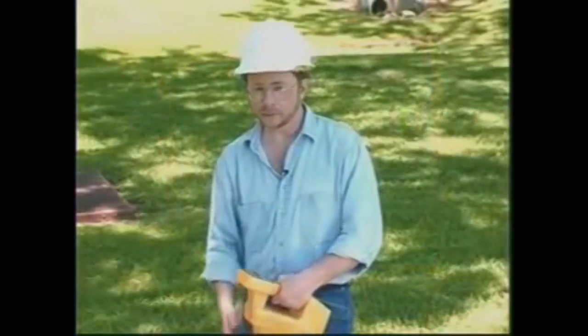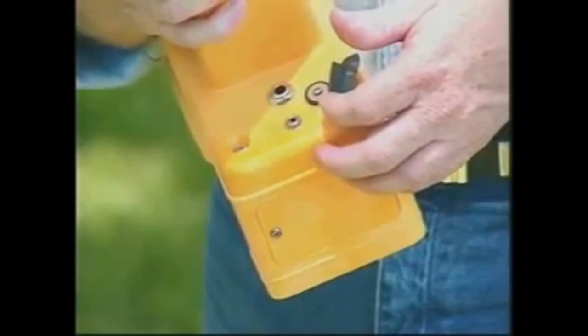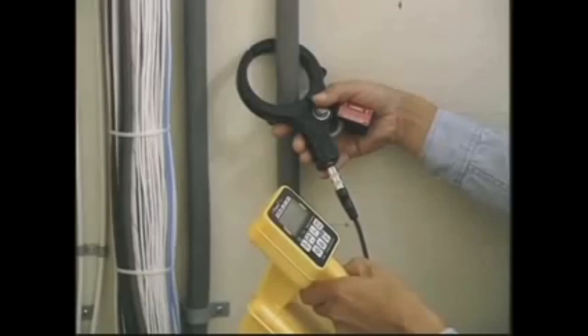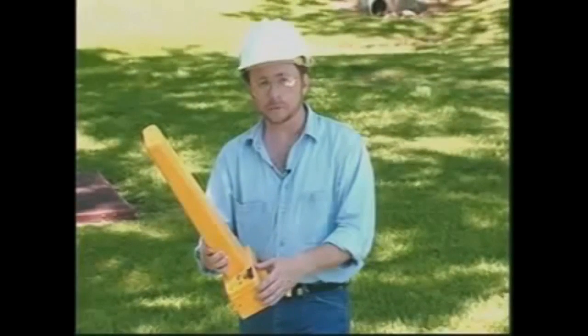On the bottom of the receiver are two jacks. The smaller jack is for headphones. The larger jack is for accessories such as the earth contact frame for finding sheath faults, the dynacoupler for cable identification, and the tone probe for pair identification. A standard toning coil for aerial fault locating can also be used.